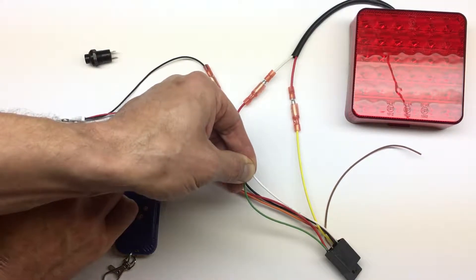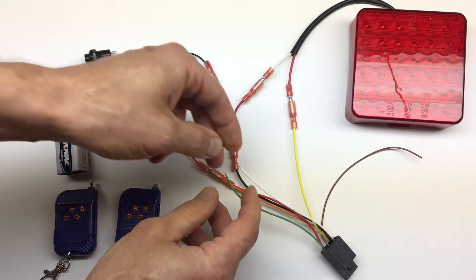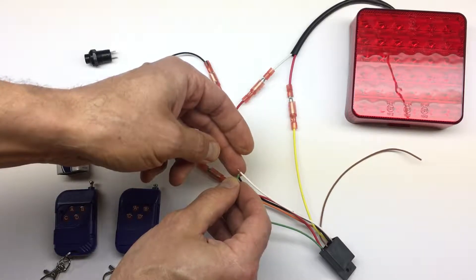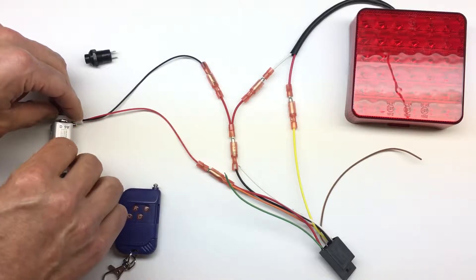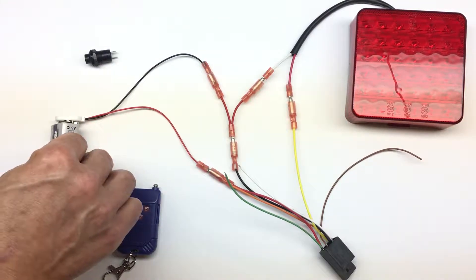The second mode is latching. Connect and short the config wire, supply the power, wait for it to blink, then disconnect. Short it one more time — the duration doesn't matter — then disconnect the power and connect it back.